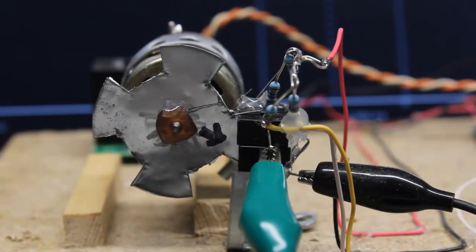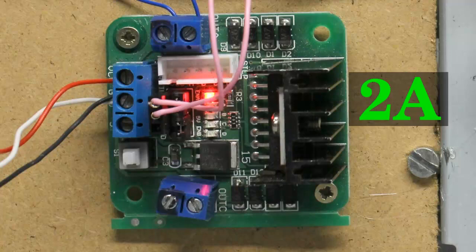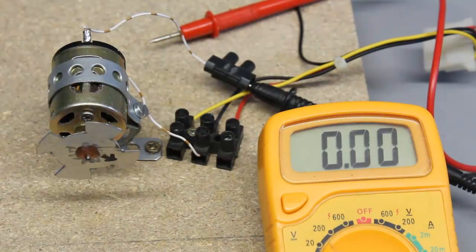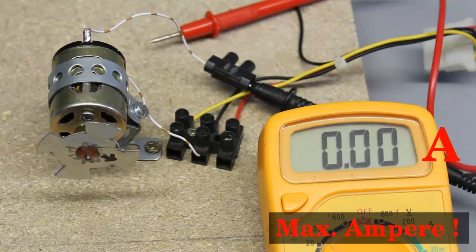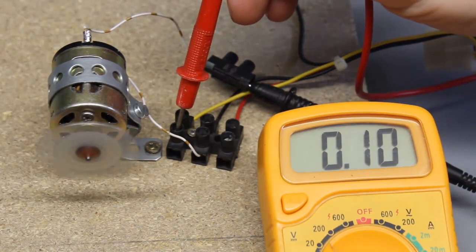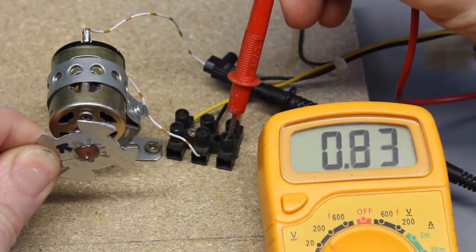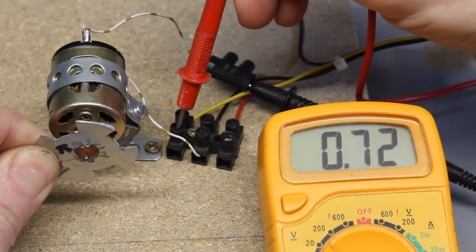What type of DC motor can be used? That's mainly a matter of the used H-bridge. This is a board with a double H-bridge based on a chip type L298N with a maximum continuous current of 2A. A digital multimeter is needed to measure the current flowing through a motor. Dial the highest range for current measurement — 10A for this multimeter — and switch it in series to the motor. If the motor runs in idle mode, it consumes 60mA at 5V and 70mA at 12V. The maximum current whenever the motor stops under load increases to almost 300mA at 5V and 700mA at 12V, so that motor can be used without harming the H-bridge.